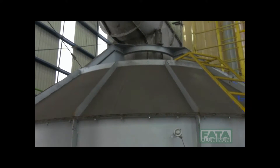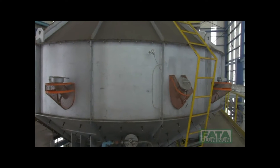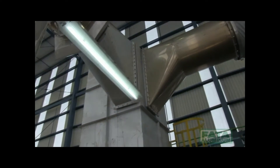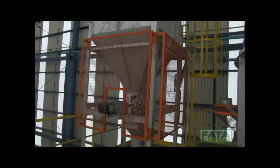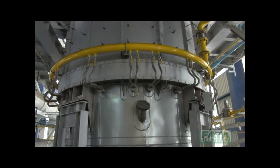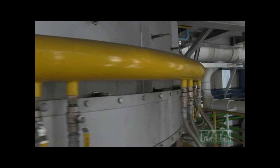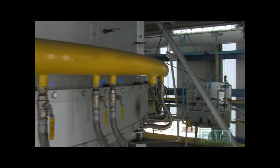The upper hood has an internal volume suited to allow the gas to stay inside for at least two seconds. The chimney stack channels the fumes exiting the furnace, mixing them with cool air so that they can be cooled down passing through the pre-separator. The metal base plate of the furnace is equipped with nozzles for sand fluidization and nozzles for gas distribution, so that the air and gas can be mixed directly inside the calcination chamber.